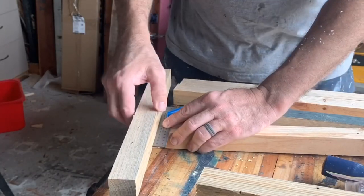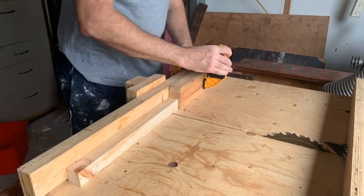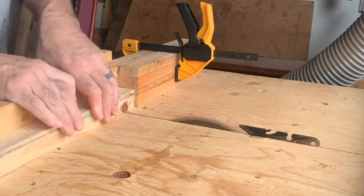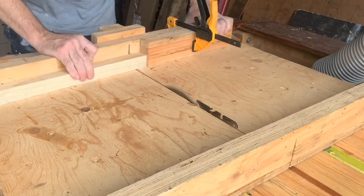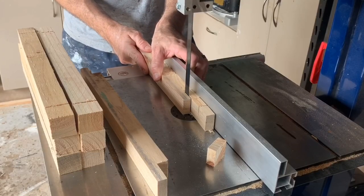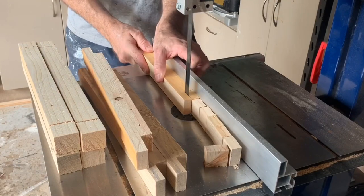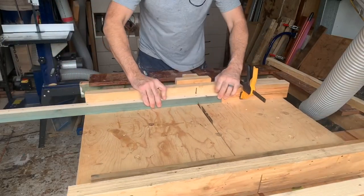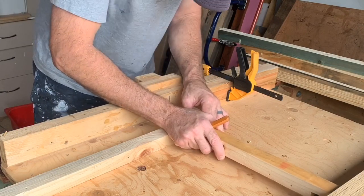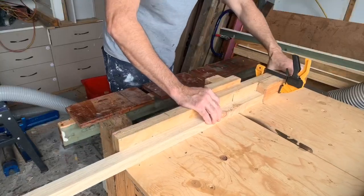So half laps - it's pretty simple. Just use your stock, mark it out, and in the quest to get better I've bought myself a marking knife. Here's my routine: table saw. I'm going to do my cross cuts with the table saw, I've set the depth, cut all of those nice and quickly top and bottom, then take them over the bandsaw and take out all the waste. It's an awesome routine and it's super fast. As a time saving measure I'm using a stop block as much as possible, which also makes sure that the lower edge of all this joinery is exactly the same height off the ground so it is nice and square.